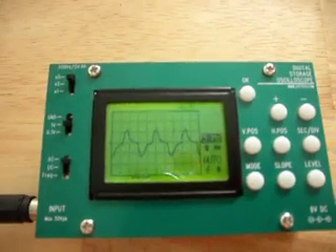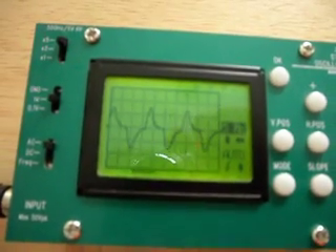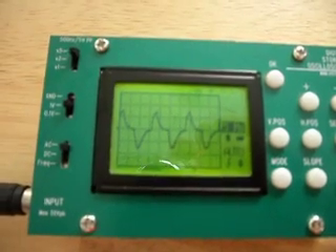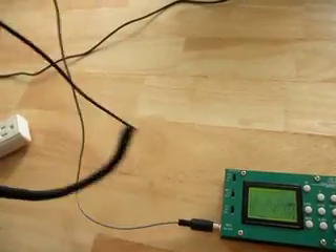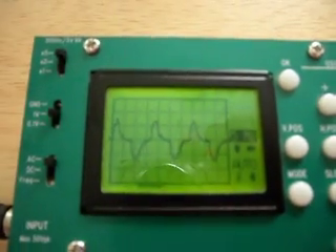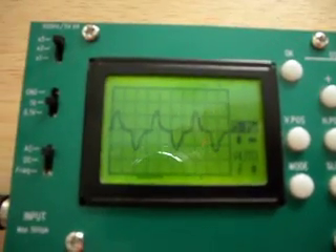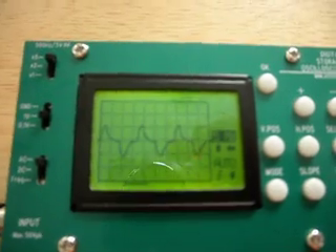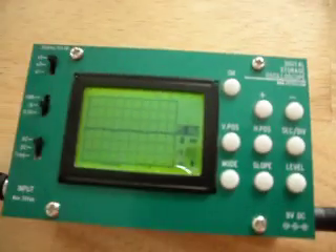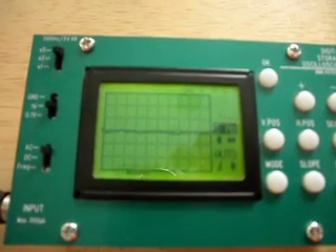Now I'm going to step off with my other foot and connect onto the house system. And again, it's almost about 20 volts peak to peak AC right now. I'm disconnected with my grounding strap, and the only thing that can possibly be generating that waveform right now is the floor. I'm going to step back onto my shoes one foot at a time — here's the first foot. We saw the waveform drop; it's just over 10 volts peak to peak. I've just stepped off with my other foot, so both feet are now insulated from the tile floor, and we're back to the waveform that we started off with.